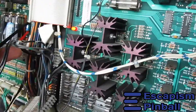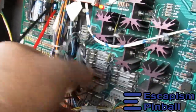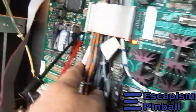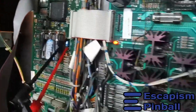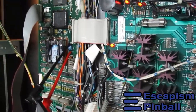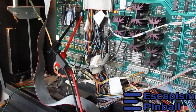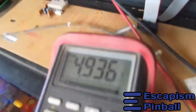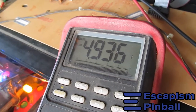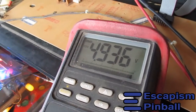From this wire here, it goes onto this little Z connector, onto that one there. And every time you have a connector, there's a little bit of resistance. And when current flows through resistance, you have voltage drop. So you see on the board itself, we're measuring 4.93. Now that's okay, it's fine. Normally if it gets close to 4.8 you're looking for trouble.